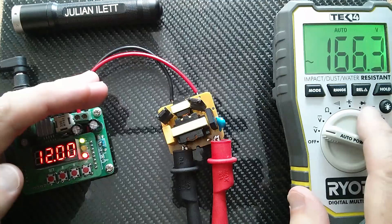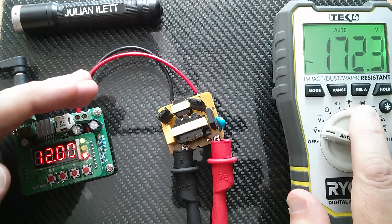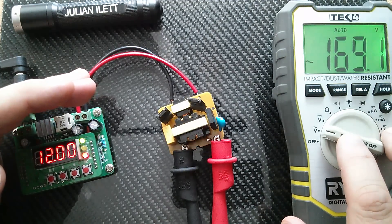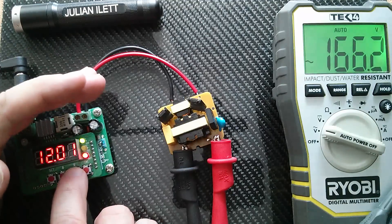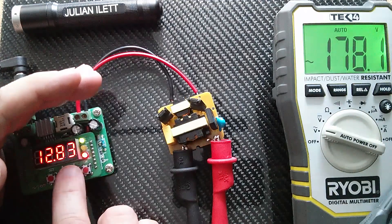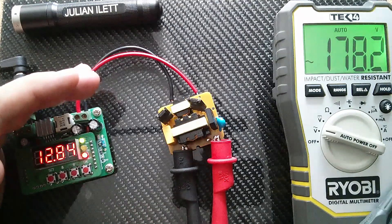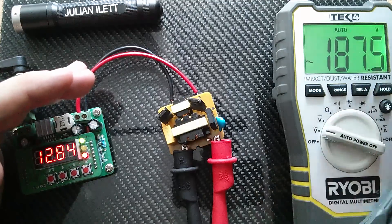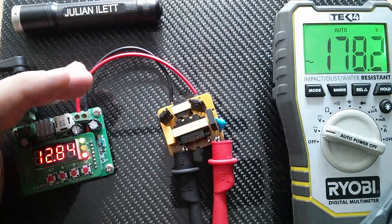So 12 volts in and all we're getting out is 160 — well, 170 volts RMS. I assume this is RMS. That's moving around a little bit. That's reasonably stable — 170 volts AC. Now can we get to 220 by raising this up? I can't raise it much because my incoming is only 13, but I can go to 13 — about 13 and a half. It's only putting out 12.8 and I'm only getting 170 volts AC out. Oh, that suddenly jumped up — 187. But it's not the 220 that this thing is meant to put out, so already this is not quite behaving as advertised.